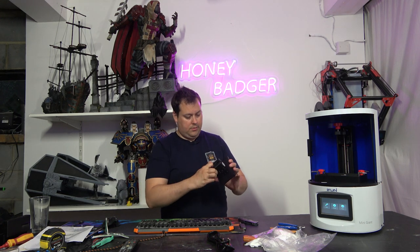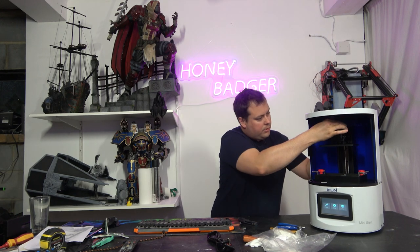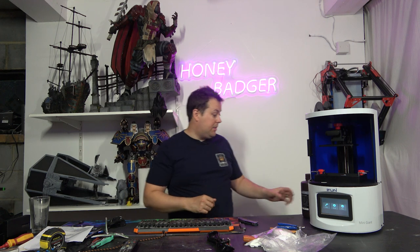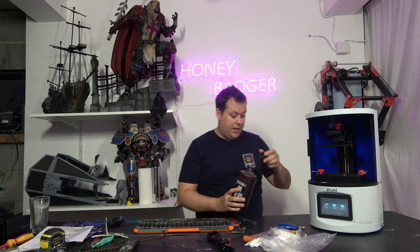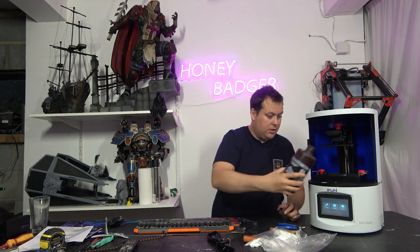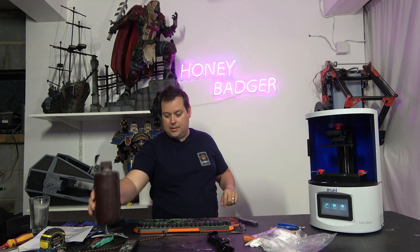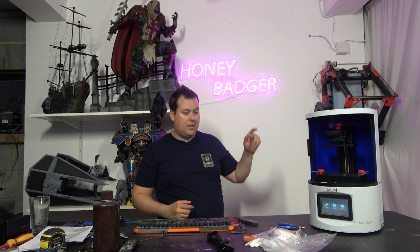Let's have a go at installing the build plate. There is a quite nice chunky handle on this. It looks to me like it's levelled from the factory. Checking the quick start guide — yes, it comes levelled from the factory. So I'm going to throw some resin in this and see what it does. I've got some Nova 3D resin that I had laying about, so let's pour that in. I don't need to fill it all the way since I'll just be doing the standard exposure test. We can also turn on the second switch at the back — that's what turns on the heated vat.